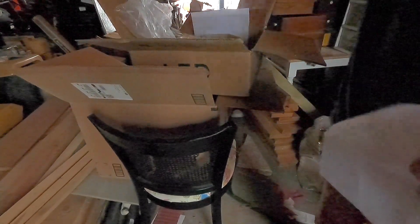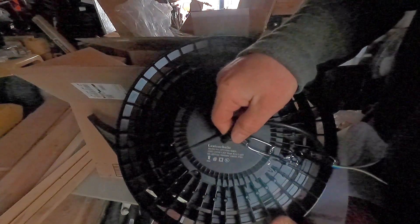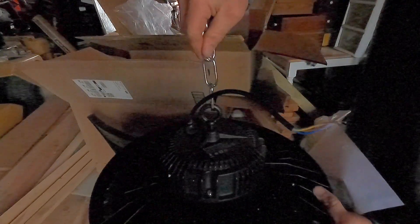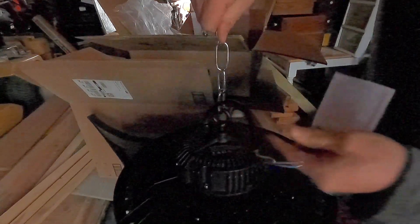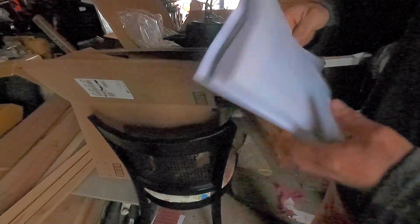Let's get in the light — here's what they look like. They've got an eye bolt you thread in the middle and then you can hang them. They've got a three-wire system. The 200 watt — I'm going to run six of them on one 20 amp circuit, and that'll be probably about 11 amps. Then I'll have like a 15 amp switch.